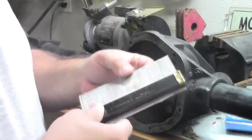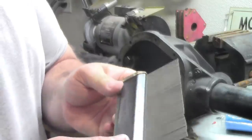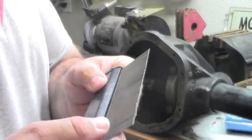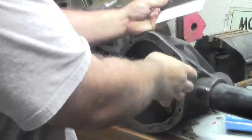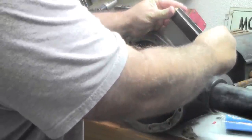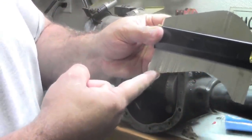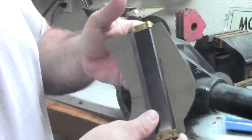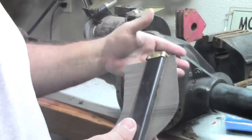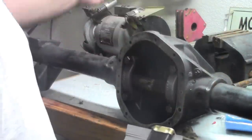So what this tool does is it has these pins inside of a — it's kind of like a ruler that pinches on them. What you do is if you have an object you want to make something that fits around, you press it down and it conforms to the profile, giving you something you can trace to make a template and then cut out of metal. In this case I want to build a truss for this Dana 44 axle and get a profile of the whole thing in one shot.